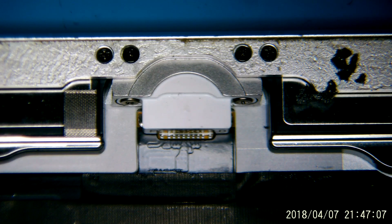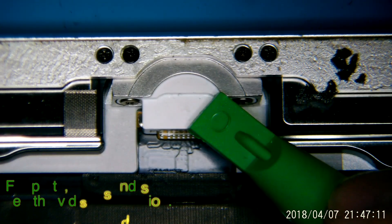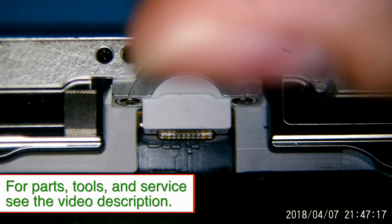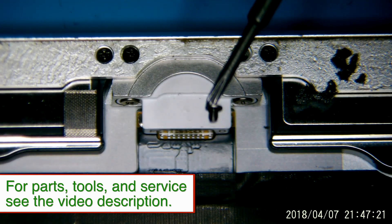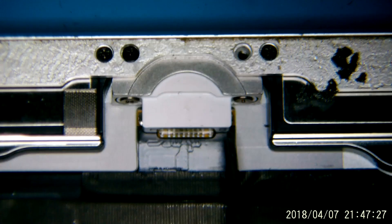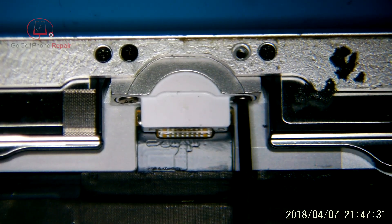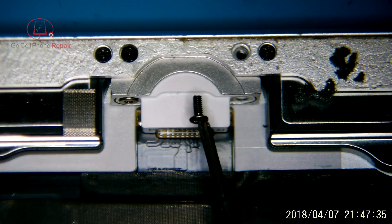This is an iPad Air, and as you'll see here, this little metal bracket is wobbling around on the inside, and this is pretty common. After a year or two, this will typically happen on pretty much most of the iPads I've ever seen. One of the reasons is that the screws at the top do not have any thread lock to hold them in place, so they will unwind over time, and whatever type of glue they use to keep this metal bracket in place fails probably from heating and cooling cycles over the lifespan of the tablet.